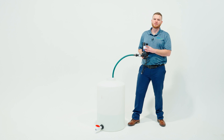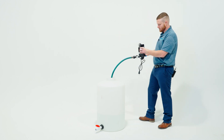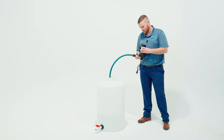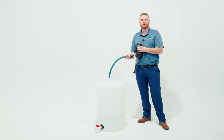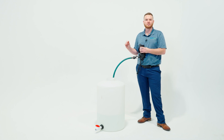The first way to install the small pump is wall mounted. So if we imagine there's a wall here, we would mount it using the four mounts provided to the wall. Next we would install our filter, make sure we have properly taped connections, and then use the hose adapter that comes with the kit. The female end of a garden hose is then attached and dropped down into the reservoir. It's important to cut the length of your hose just to where it almost touches the bottom of the reservoir, but does not touch the bottom, preventing the pump from being able to suction.